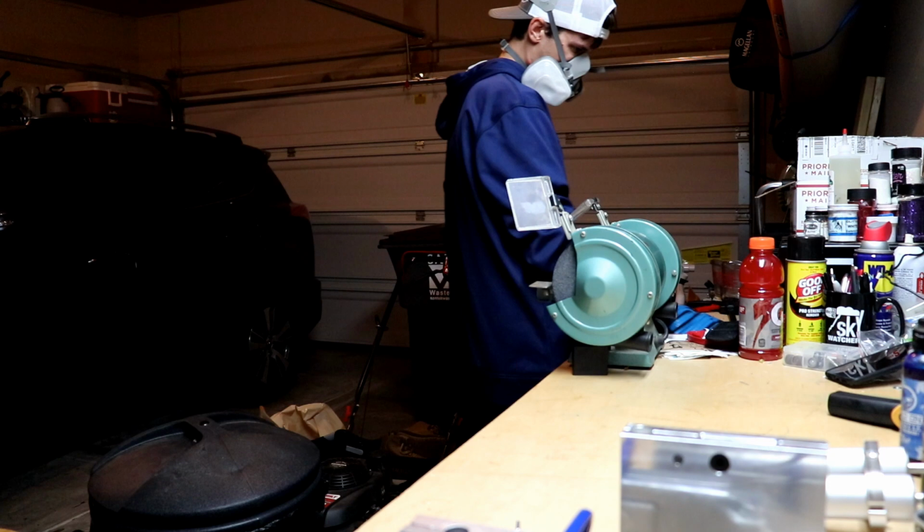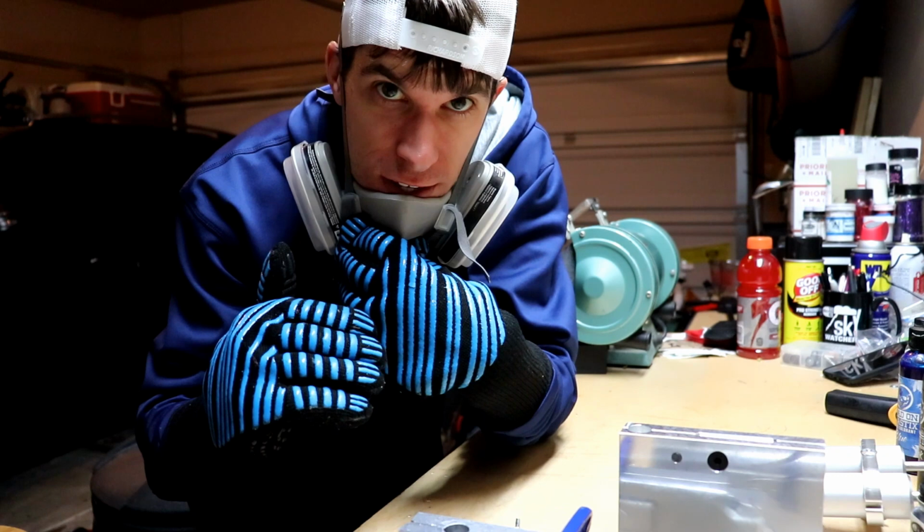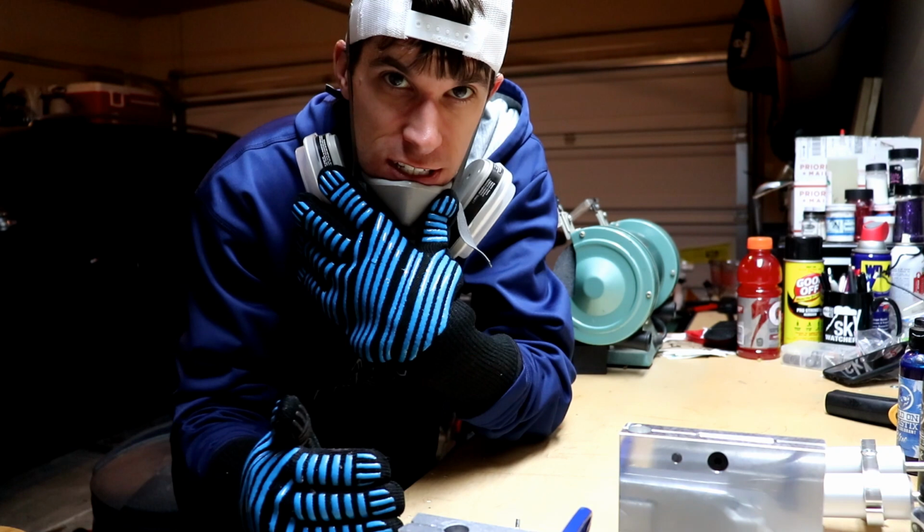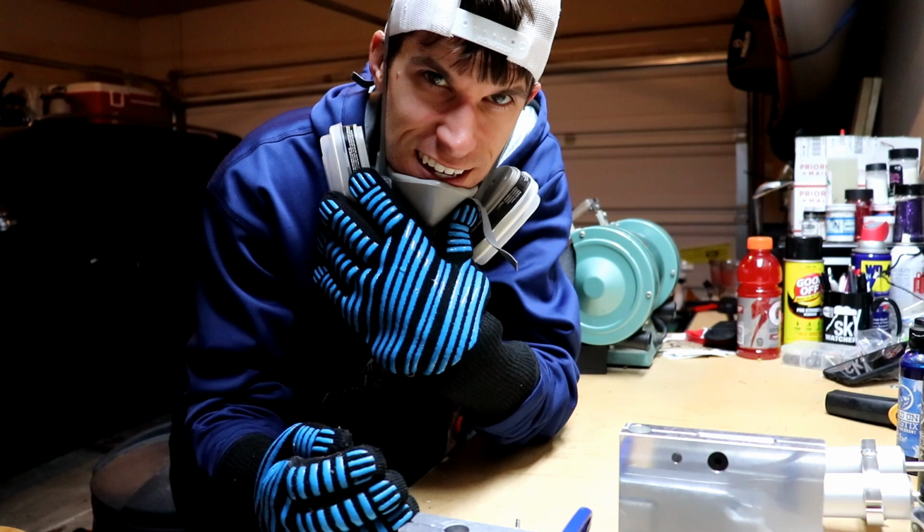I can't say enough how important it is to get to 350. Really anywhere between 350 and about 380, 390, you're completely fine without burning it, but you've gotta reach that point. Otherwise, you're gonna get this jelly. It's just never gonna cure. It's gonna almost feel sticky and jelly-like, especially with the dead-on plastics. But you hit 350, you are golden.